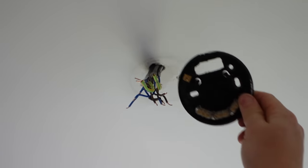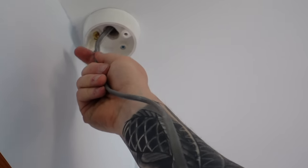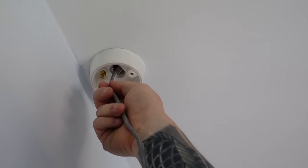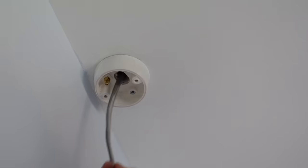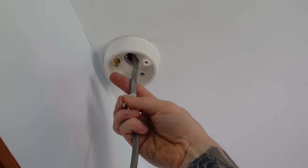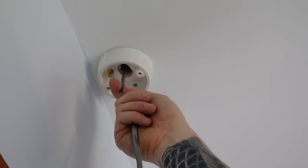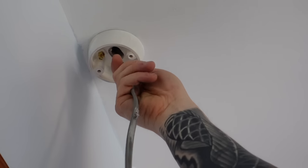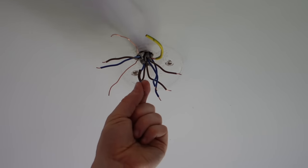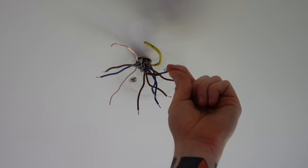Keep this safe and lay it to the side. What you'll be able to do now is pull this cable, and if you're doing this downstairs, you'll start to feel a bit of tension because you'll be pulling it through the centre of a joist more than likely. If it feels like it locks up and snags, stop pulling — you're going to have to find a way to gain access to the cable. The one you're pulling will be the one with the brown sleeve on it, because that's a switched live. If you see that brown sleeve, that means it's a switched live.